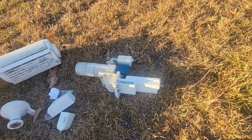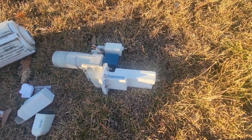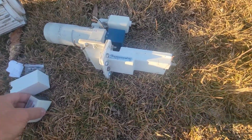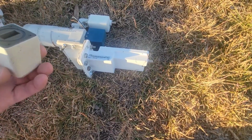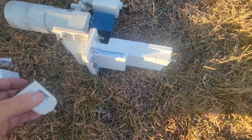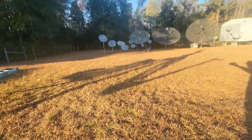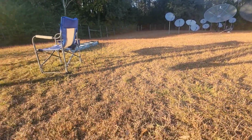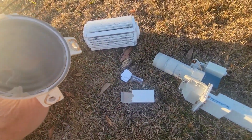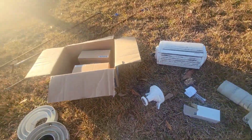And basically, since I have a switch, they won't be both active at one time. I'll be running through an A/B switch. Then when I go to horizontal, I'll be on one switch, and when I go to vertical, I'll be on another switch. So I'm gonna try that as well. It's just to see if it'll work. And if that don't work, then I got another option. I can use one of those LNBs, kind of rig it up with a scalar ring on this one here, pull all that off, and kind of tie it into this. So I got 3 different options.